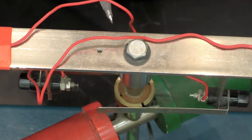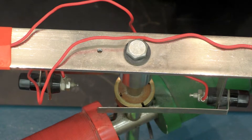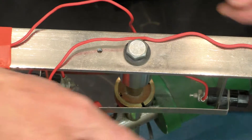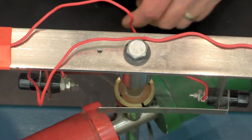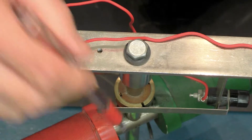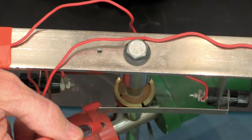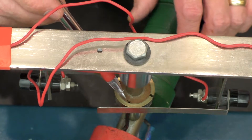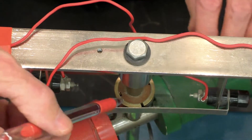In the middle here, we have a current of opposite polarities coming into this contact and to this contact — so this would be positive, this would be negative, for example. That contact is connected up to this, which is called a brush. Here's one on the front side — you might be able to see better. These are the brushes of the motor.